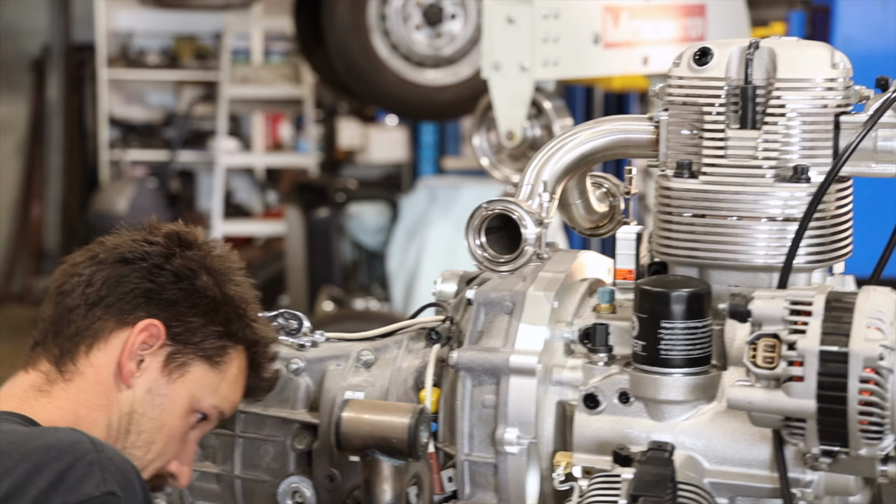Okay, so now that we have both these mocked up into place, it's time to get this guy to this one here. So that mid plate's going to sit about here. We do know we have a little bit of room. What I'd like to do is get this to travel down and then immediately into two 45 degrees just to kick it over so it comes down here. Once it's placed down here, then we can put a 90 degree that will go down along the bottom of the head, and then we can fix it into this one here.